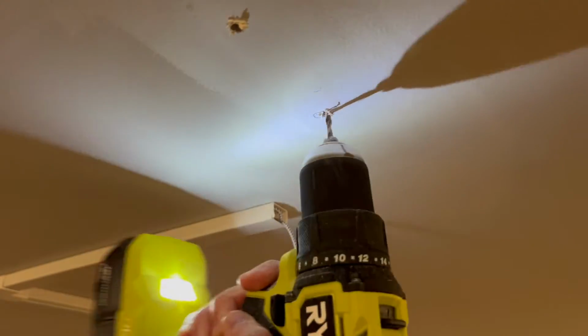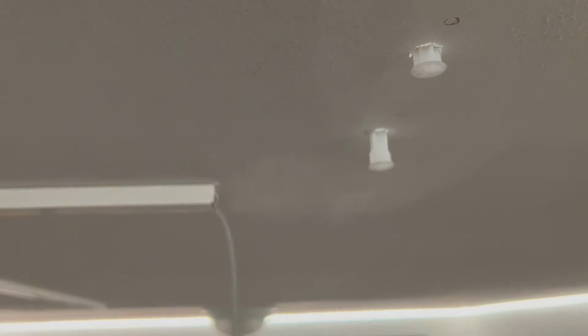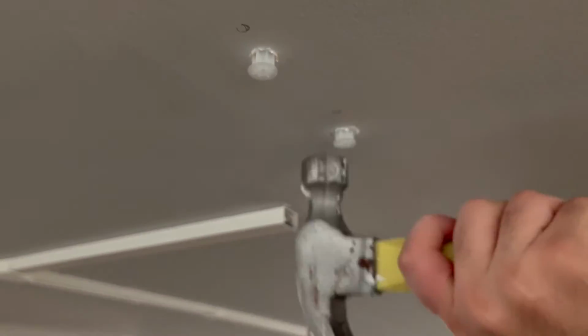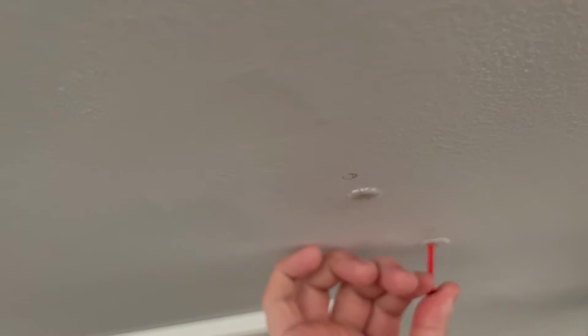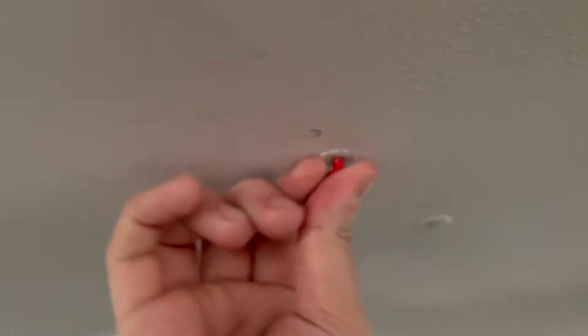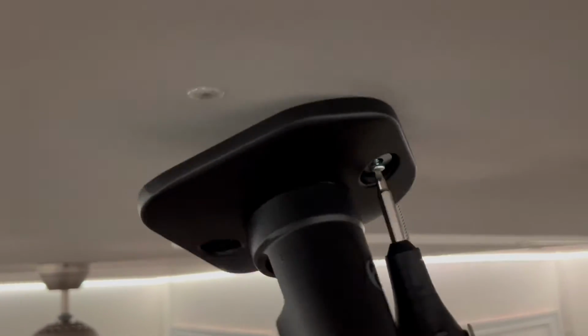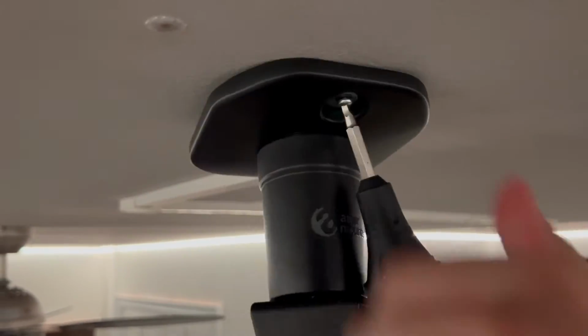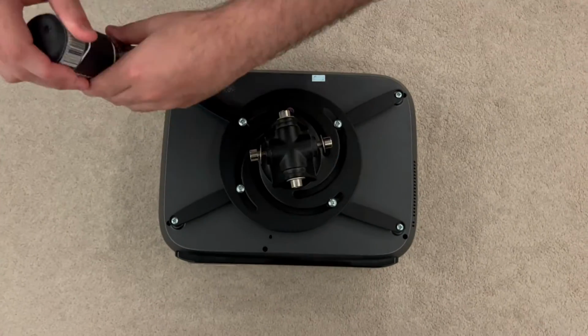I like to use these little T-shaped wall anchors from a company called Toggler. Now, the cool thing about these is that you sort of pinch them into a single line and then you hammer them in. Once they're in, you use this little pin thing and you try to open these inside the drywall. And then when you screw in, it actually sort of expands and holds the anchor very firmly into place. These are better than basically every other plastic wall anchor out there.